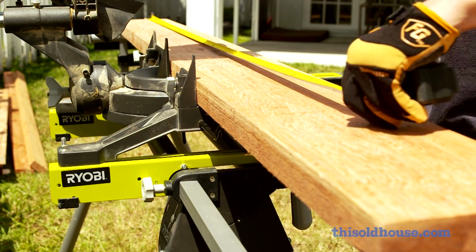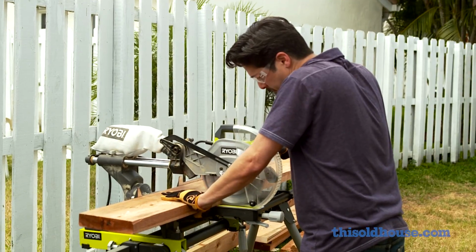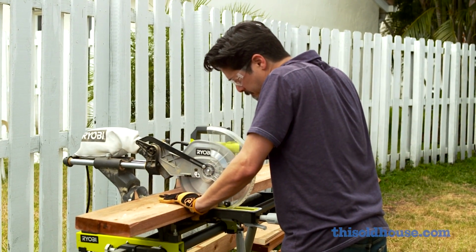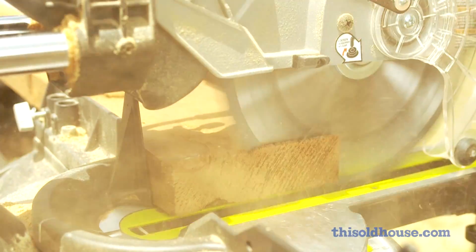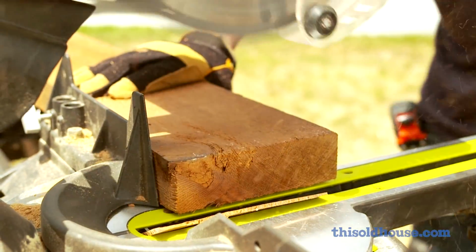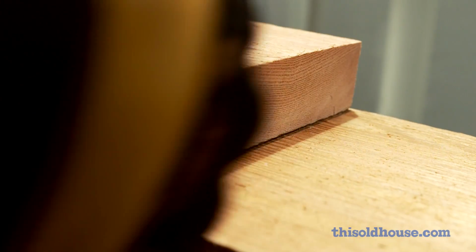Cut a 2x8 to length on the miter saw. We made our table 6 feet long for 6 adults. If you need more room, leave the boards 8 feet long, but be sure to dress the ends. Shave a little off to leave a clean cut. Use your first board as a template to mark the others. That way, they'll all be consistent.